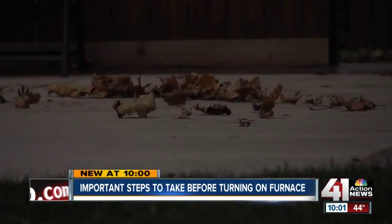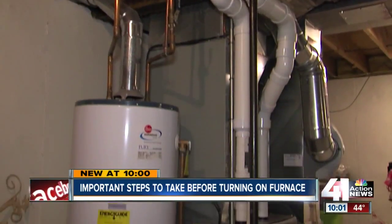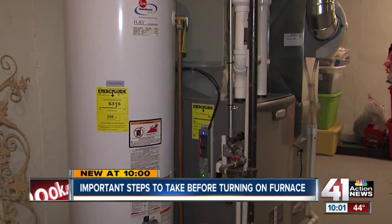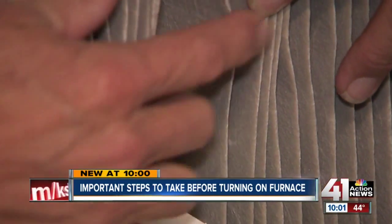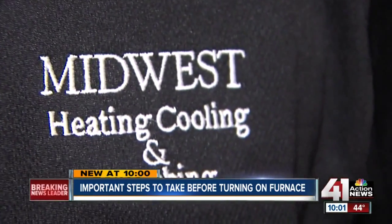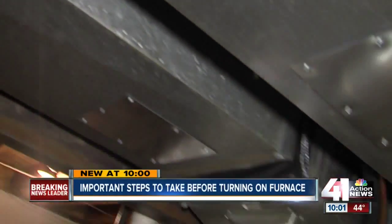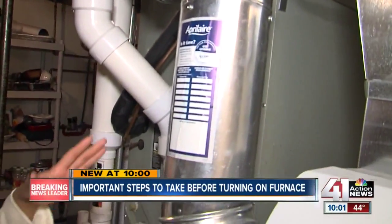It's one of the busiest times of the year — the phones are ringing off the hook. People want to make sure their furnace is ready. That starts with seasonal maintenance. You have to make sure your furnace filter is clean. Jack Lambert owns Midwest Heating, Cooling and Plumbing. He showed us what they do on a call. If you have a humidifier, which is very important in the winter, make sure that filter is clean, the damper is open, and you have to change the water panel. This is where the air comes from when you turn on your furnace, and that airflow is just one of the things a certified technician will check.